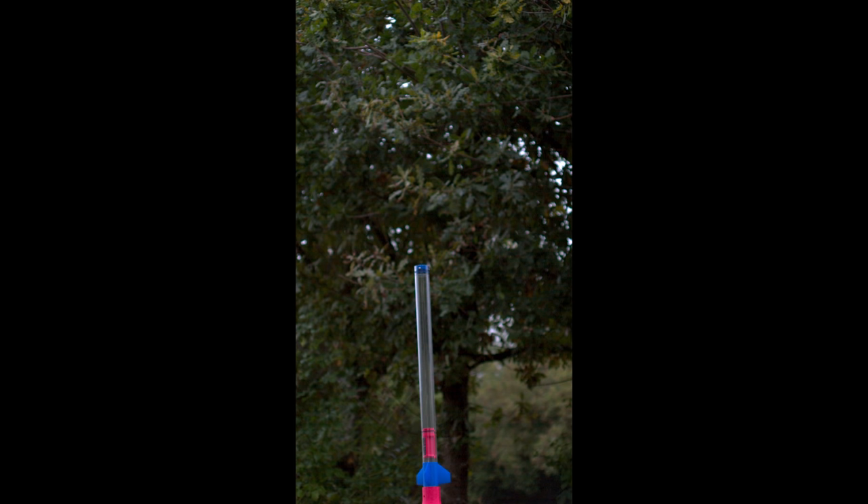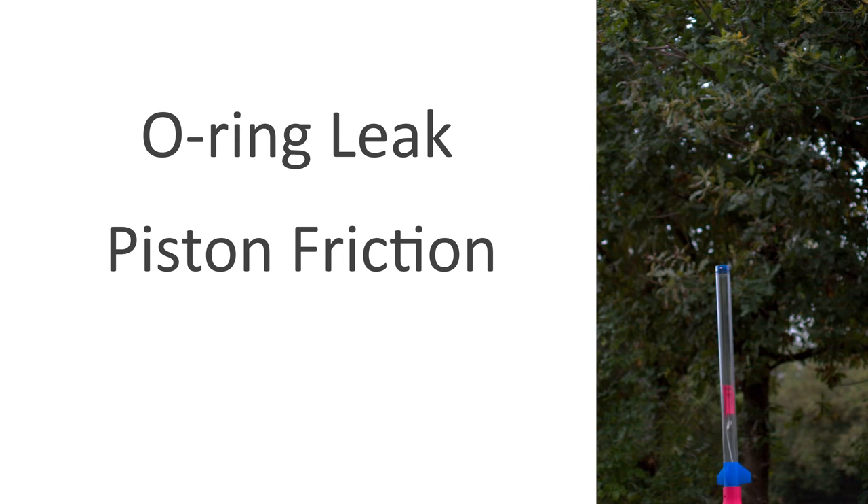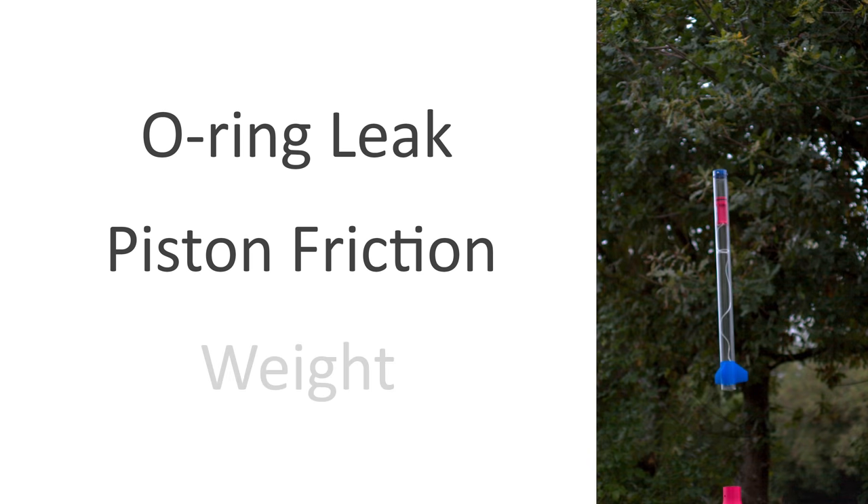The piston reached an upwards velocity of 19 meters per second, but due to the high mass of the acrylic tube, the end velocity of the piston and cylinder was just 4.8 meters per second. It seems like there are multiple factors that need to be fixed: one, the air leaking around the o-rings is reducing the strength of the vacuum; two, the friction of the o-rings sliding up the cylinder is preventing the piston from reaching a high end velocity; and three, the weight of the acrylic tube is just too high, making for a low end velocity after the momentum transfer. Let's move on to plan B.